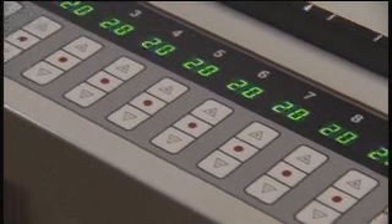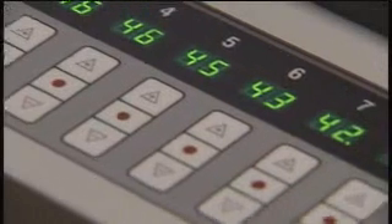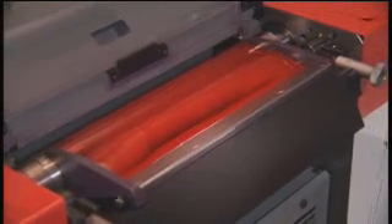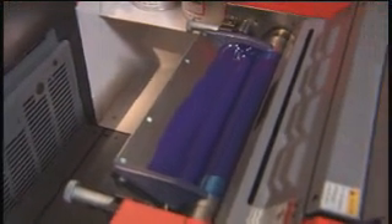After plate cleaning, the ink keys are automatically adjusted and the ink fountain is set up. That beeping sound indicates that the ink keys are finished. Now the press will automatically deliver into each ink train the amount of ink required for each specific plate. This automation dramatically reduces setup and waste sheets, thereby increasing the profitability on each job.